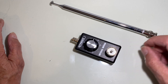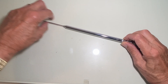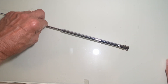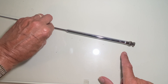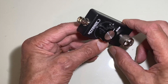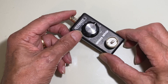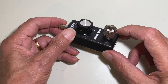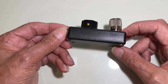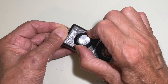The package comprises the main control unit and a telescopic whip. Fully telescoped out, the whip measures 1.3 metres and is in 10 sections. Folded, it is 20 centimetres long, and here you can see a BNC connector for the control unit. The control box is a small plastic enclosed item. On the top you've got the BNC antenna socket, and on the bottom you've got a PL259 connector for your antenna socket. On the top you've also got this control unit which goes round in click-stops.